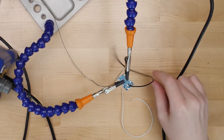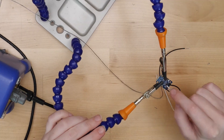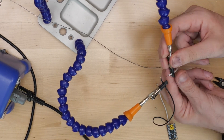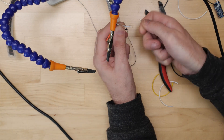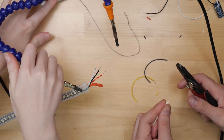The board is powered directly from the scooter's 12-volt power, so we attach wires to the power and ground pads on the back of the board. Since the pixels can't handle 12 volts, they're being powered by the Trinket's voltage regulator, which isn't generally a good idea. But since there are so few LEDs lit up at once in this animation, we can sneak in under the regulator's max current output.